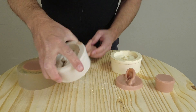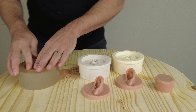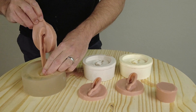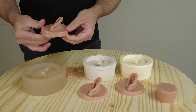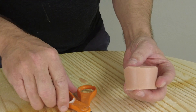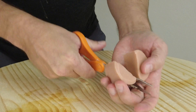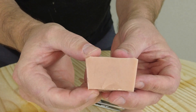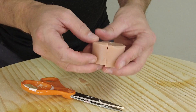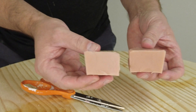The name of the game for this whole casting process is compatibility — everything needs to be compatible, from your pigments to your mold material to your mold release, especially when casting into a silicone mold, which must be a compatible platinum silicone. Everything in this process is a variable; changing pigments or other materials can create a chain of events that results in cure inhibition. Now, that dixie cup we filled with unvacuumed silicone — the cross section is essentially bubble-free with no major air bubbles. Those of you without a vacuum chamber can still get very good results without vacuum degassing.